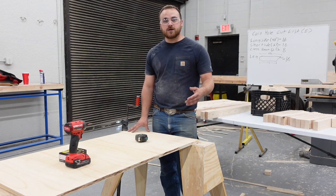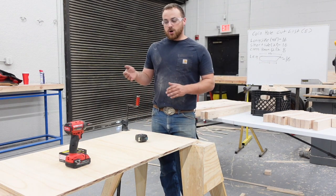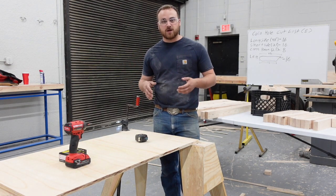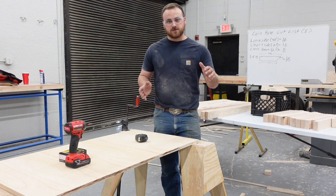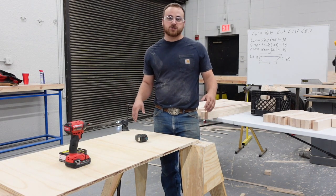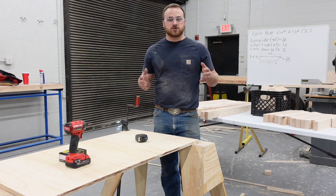The reason I have this sitting here is I want to make sure that we're sitting perfectly square on all sides when we get our frame set up. Setting the frame up square in the first place just keeps you from having to make adjustments later on, putting more strain on your fasteners and your glue and your top piece, just making an overall better, stronger product.